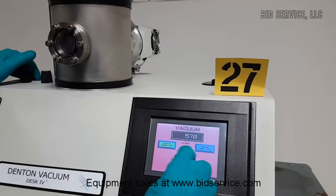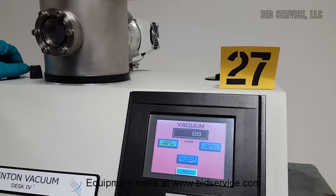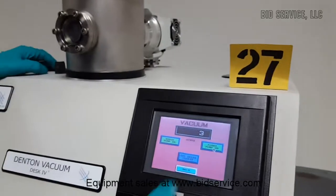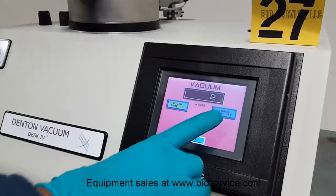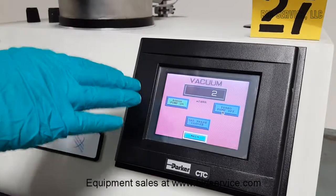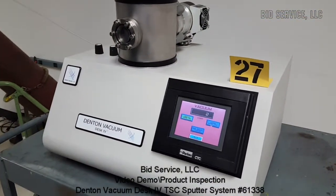I am going back to close the gas valve. The roughing pump is pumping out the residual gases inside the chamber. Closing the needle valve and turning on the turbo pump. Now in order to proceed with venting the chamber to replace the sample, turn off the turbo and wait for 20 minutes. Then turn off the mechanical pump — the roughing pump will stop and the vent valve will open and the chamber will be vented in order to replace the sample. Then turn off the machine and the valve, and vent to atmosphere on the chamber.